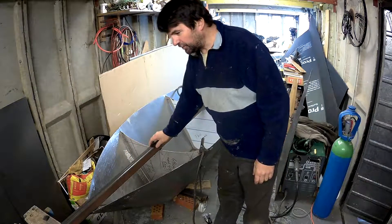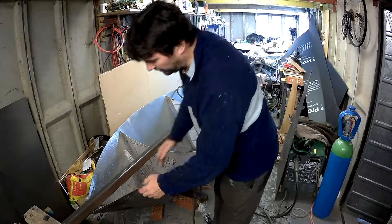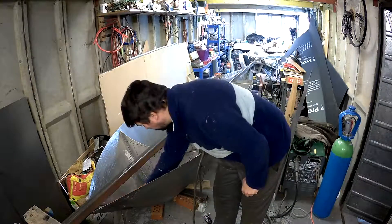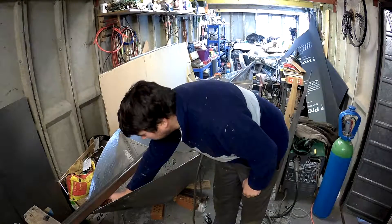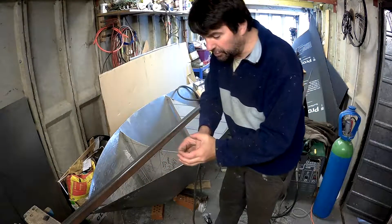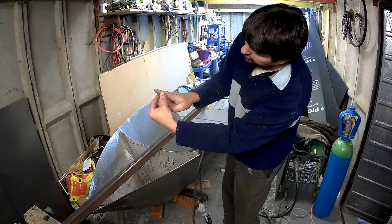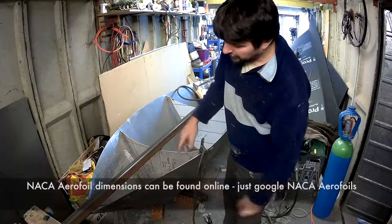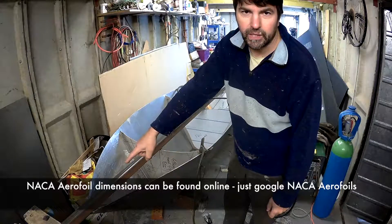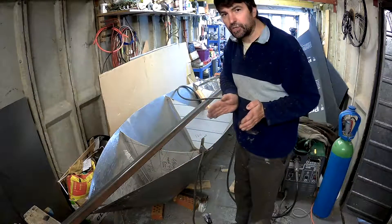This is the backbone that I've built the keel on. Again I've got distortion running against me. This is the front piece of tube which used to be my GPS pole — repurposed. I've cut it all down; it's pretty heavy section steel so it's good enough. The curved shape is great because measuring around the tube it matches the NACA 0010 profile I've been using on the base, and pretty much the same as the NACA 0018 for the top section — the aerofoil profiles I've chosen for this keel.